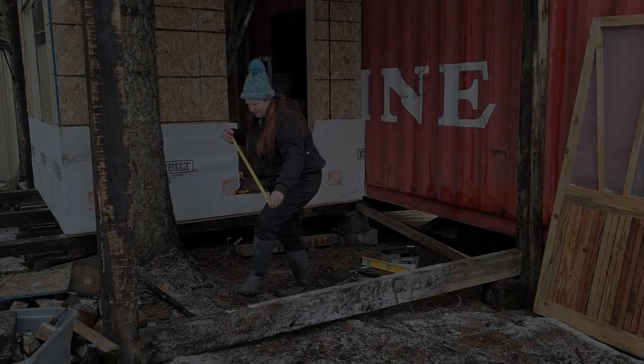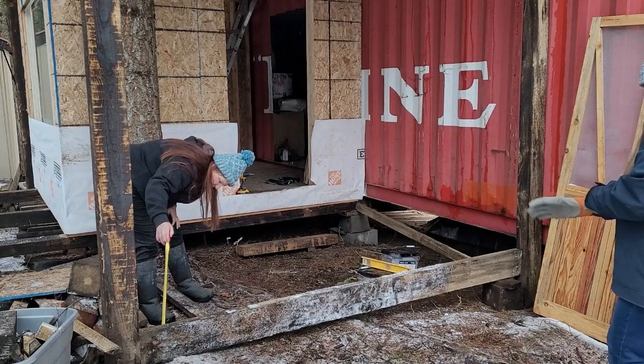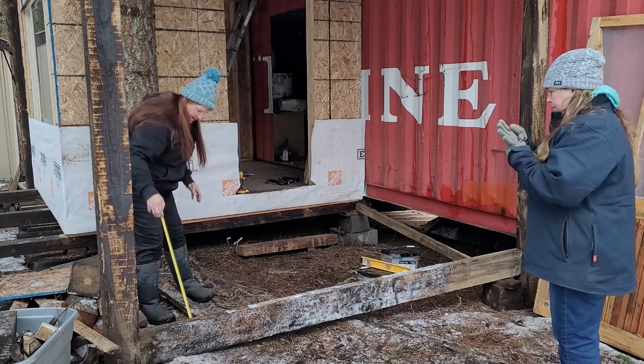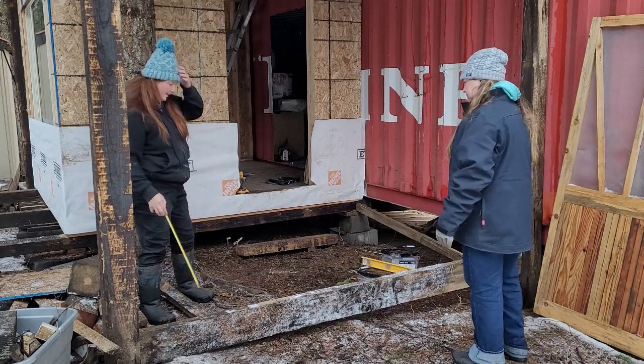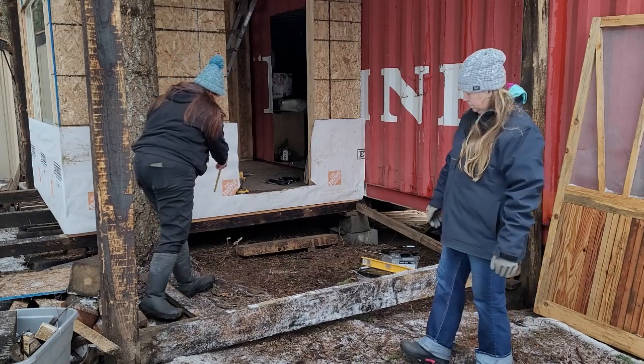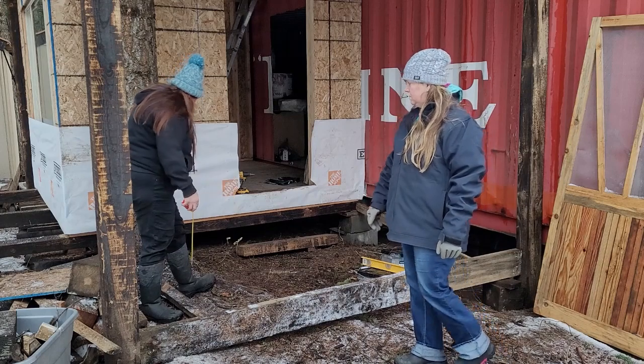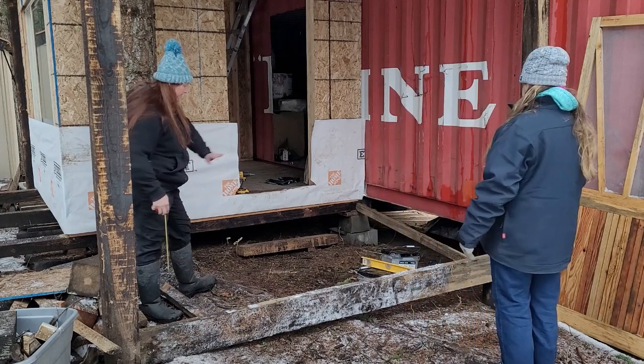Okay, cats on this side have stuff that is shorter than a 2x8. So if we have those 2x6s or something, they can get here. What we'll end up doing is a solid one that goes this way, and then we'll come this way, and then we'll do short ones here, so we'll box in the tree. Okay. And then the decking will go around that.